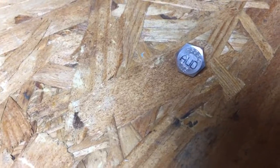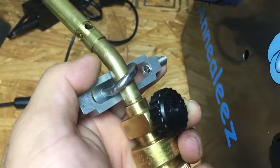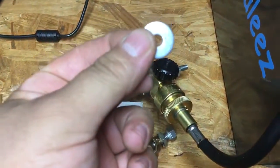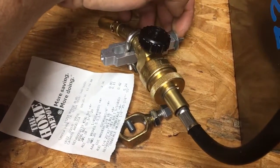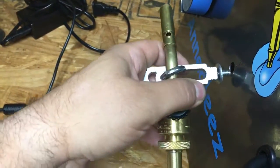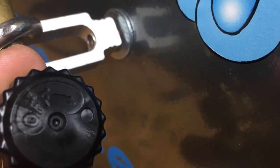The bolt had a head on it — that's the part number at Home Depot. I cut off the head and using red permanent Loctite, I put it in almost level with this end right here. It's permanently locked into place. I also found a washer — the hole was a little too small so I had to drill it out. I wanted it really tight against the bolt. Put a washer on there, put it through the hole, and on the other side we're going to use another washer and a wing nut.